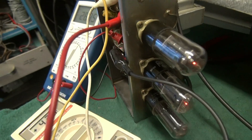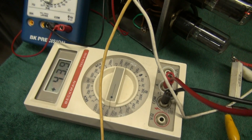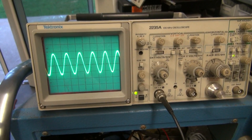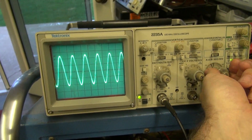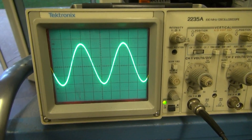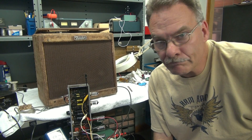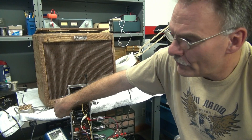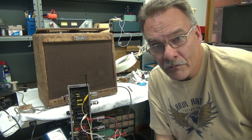I've let it sit here and bake for a while. You can see the tubes are lit up, hanging around negative 28 volts, about 44 milliamps — so that's 22 milliamps per tube. Let's go to the scope. I'm going to turn up the gain. There she is — this thing's working. The sine wave looks nice and clean. Super clean. I think we got her. Still monitoring the amp, sitting right around 44 milliamps. Great signal over here on the scope. Still got good stable negative bias.